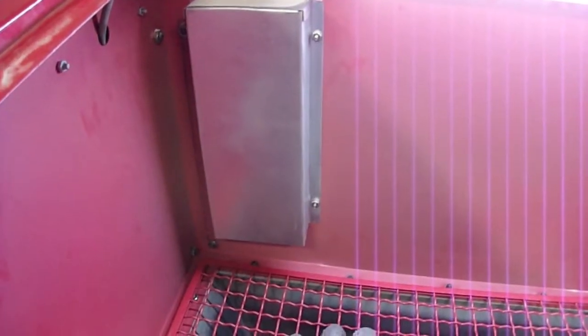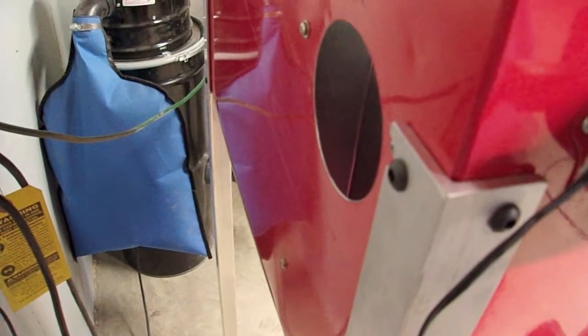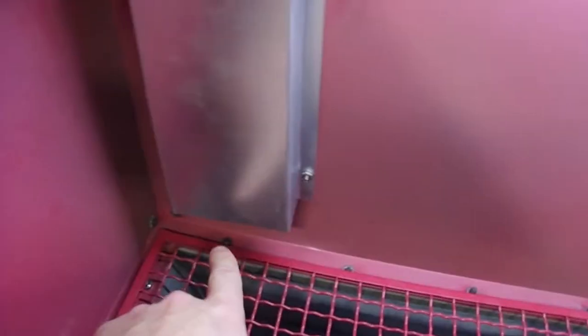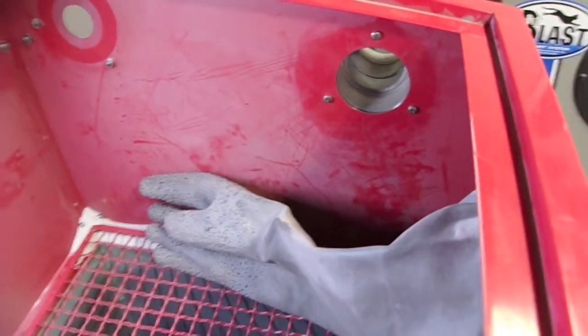And then I also drilled out the back side, because the back side had a very small hole in it which was restricting airflow. It was only like 1.25 inches or something tiny, and you can see here I drilled it out to I think about 2.5 to 3 inches, and I built and put on a little air diverter too, so it sucks it up from here but diverts it down to the bottom. So we're drawing air in from this corner, and completely diagonally we're going over to the other corner of the box, so we have the maximum airflow across the whole enclosure, instead of like it originally was, starting out of the top and then going over to this corner of the top. That's where the original vacuum port was.